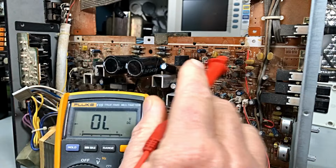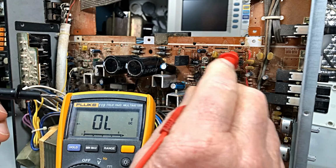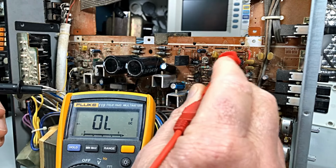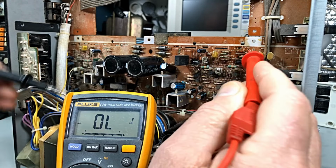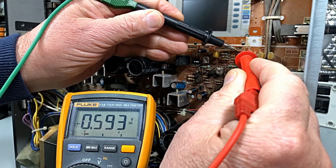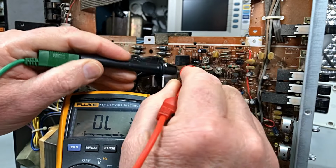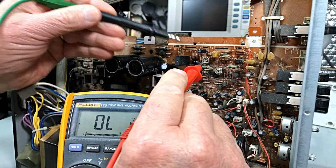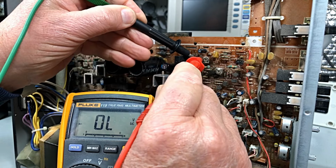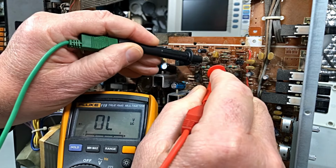let's do a check on some of the diodes here, and I can actually tell you which ones, if we find any dead ends, which one it is. So we're going for D417. See there, he's okay. So now we'll go to this one, D419. Can't see the line, the ring on him. He's okay. Okay, little fellow in here.